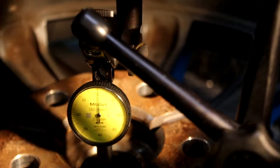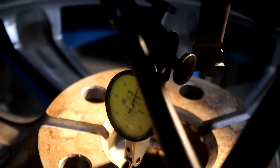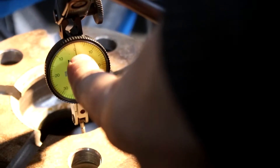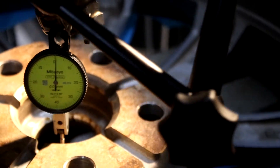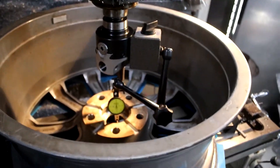The small variation going around is probably 0.01 to 0.02 of a millimetre, which for a wheel hub is well more than enough accuracy. So I can pull the magnet off now. We know that when we cut down inside, we're exactly lined up with where the original bore was.